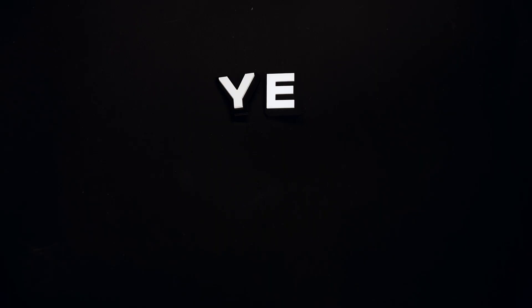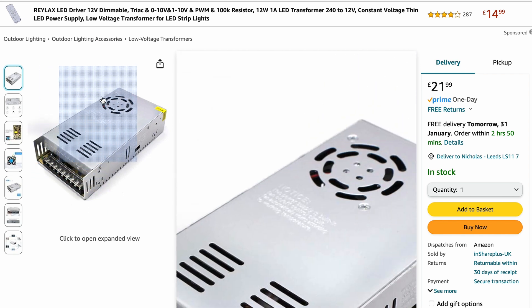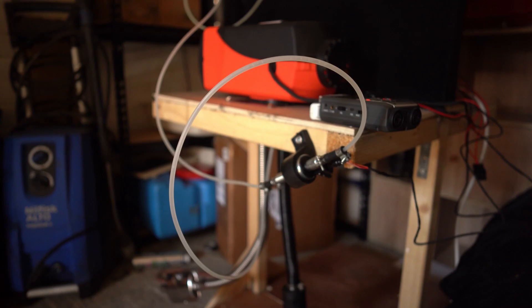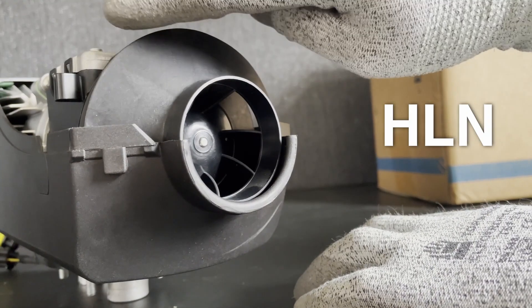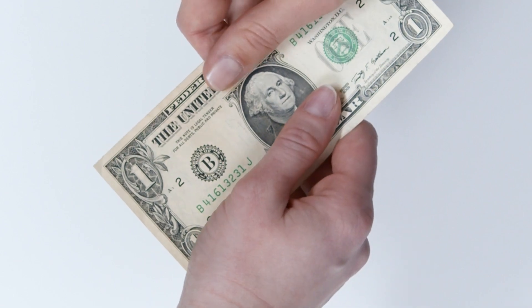Question two: can you run them on 240 volts? The simple answer is yes, very easily. All you need is a 240-volt to 12-volt transformer — this one is 30 amp and can power these heaters no problem. You could get away with a 15 or 20 amp unit as it only uses about 11 amps on startup. However, there is a risk of frying your motherboard and wires if there is a sudden power cut and the heater can't go through its cool-down process. It wouldn't cost too much to replace the affected parts, so you can decide whether the risk is for you.